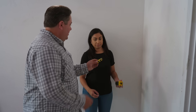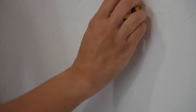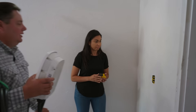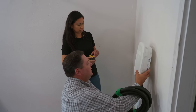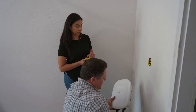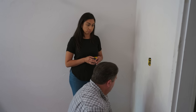I'm going to give you the tape measure and a magnetic stud finder. What we want to do is find a stud in this wall, now that we know this is where we want the charger. I want the stud because it's going to be a much more rigid mount, and I don't have to worry about it falling out with a wall anchor. Just wave that magnet around the wall and drag it until we find where it sticks — then we'll know there's a screw holding the drywall on. We'll put the charger right on that, somewhere around four feet, and the cord's going to wrap around the hook down here, which gives us a spot to put the receptacle right there. Then I'm going to measure to the center of this stud from the corner wall, go to the basement, and find this location.